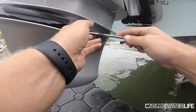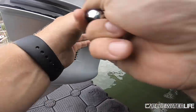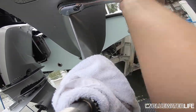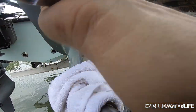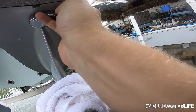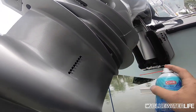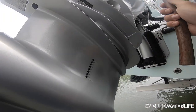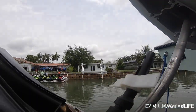Now it's time to remove the lower unit. On the bottom side there are five bolts — three-quarter inch bolts, two on each side and one in the back on the bottom. Remove those bolts to get the lower unit off. The fifth bolt is under the bottom side of the lower unit — be careful because the nut will fall right out if you're on a lift. If it doesn't slide off easily, use a little CRC or any lubricant in the bolt holes, then tap the lower unit with a mallet to loosen it. Once loose, it'll slide right off — it is heavy, so be prepared.